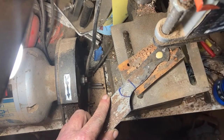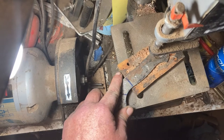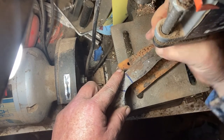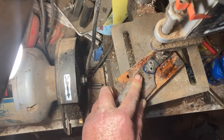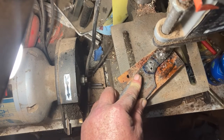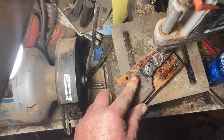Now drilling those holes out. I'll put a little bit of lubricating fluid on there just to help keep the bit cool and help it go through the metal a little bit easier. This bit I'm running through is an eighth inch bit, and then we're going to go back through with the quarter inch bit for the back holes. The pins in the handle I use a quarter inch, so I start with my eighth inch bit and then take the quarter inch through. This steel is fairly hard already, so taking the time to go with a couple of drills works better.